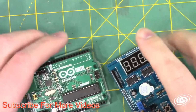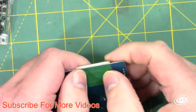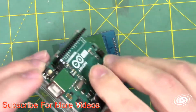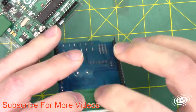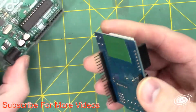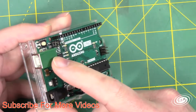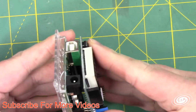Now, one of the issues with this board, and again, I think it was literally $3 with shipping. I had to put some tape under these pins right here, because first the pins came long and I had to clip them back. But they still rubbed on this metal casing and were grounding themselves out. So the display was being grounded, or some of the pins were being grounded. So I put 2 layers of electrical tape on here and one on top of this USB port shell. And you could actually see when I took it off, there was an indent into this where it was grounding out.